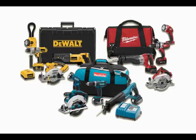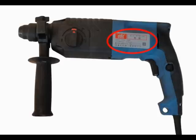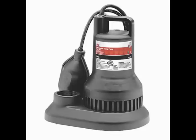With other types of devices that have motors or compressors built in, those start-up wattages can be as high as 2 to 3 times the listed wattage found on the power label. You'll have to compensate for that when selecting the power inverter.